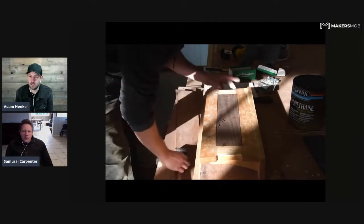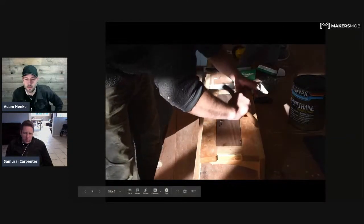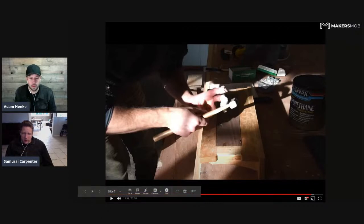So yeah, I'm just using little 3/4 inch picture frame nails. And that's a solid panel, right? Yeah, it's just a 1/4 inch piece of walnut, and then I painted the chalkboard paint on one side. Did you leave a hair gap for expansion in there? Yeah, a 1/16 all the way around the perimeter is plenty for any kind of movement and wiggle room, I like to call it. And then just a couple nails on each side, in on an angle, and then I pounded them flat so that they don't stick out.